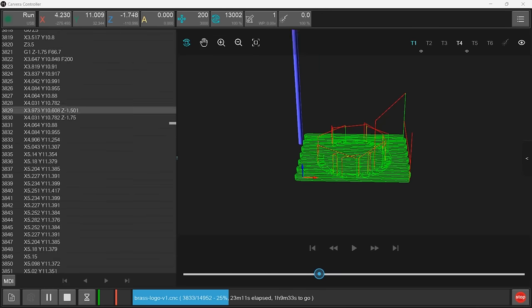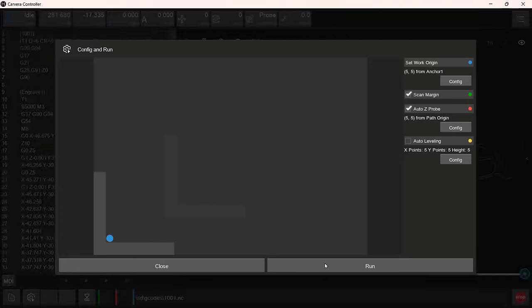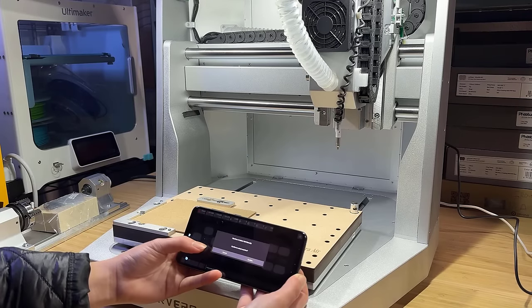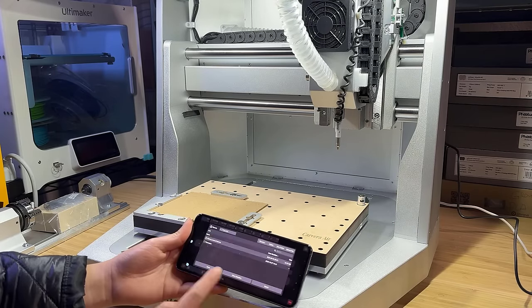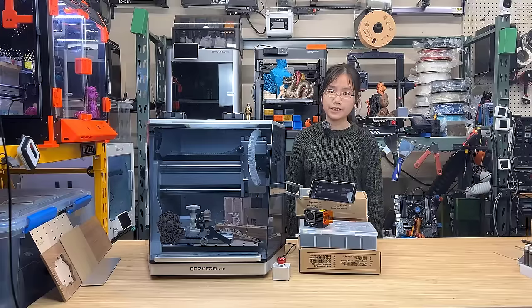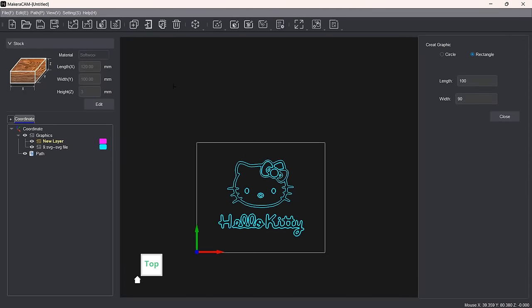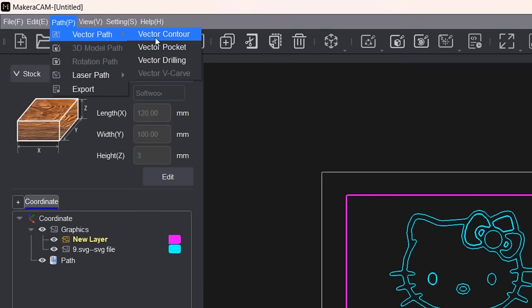6. The controller software works well. It's much better than other standard Grbl CNC G-code senders and is customized for this machine. The program is cross-platform. If you choose to connect to the computer using a USB cable, you can use Wi-Fi to connect the app to a phone or another tablet as a remote controller. This makes using the machine really handy. Their own CAM software has also finally been launched, and it's easy to use, and it supports basic contour operations for engraving, cutting, and PCB milling.